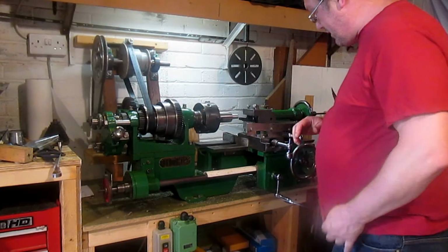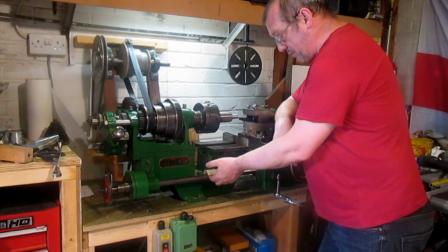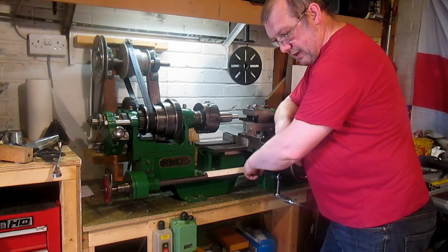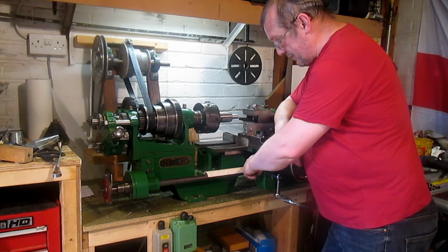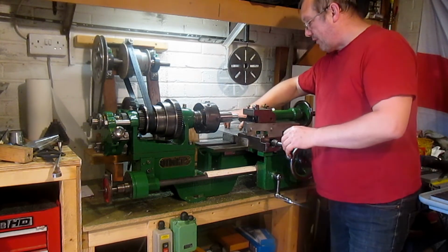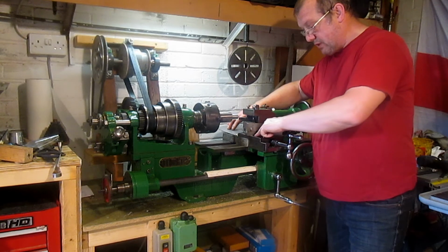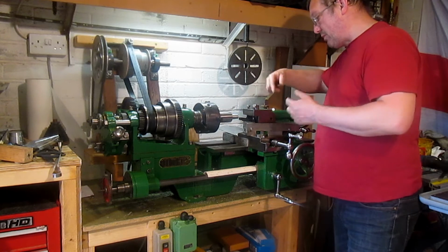And you might be able to see I've made some additions to the machine. I put a cover on the lead screw. That's just a piece of PVC waste pipe that I've cut in half. It's just got a little self-tapping screw into the top half nut on there. I've put the cover on the back here. That's fixed on again with a couple of self-tapping screws into the top sliding piece of the cross slide, so that actually runs across with it now. That's fine.